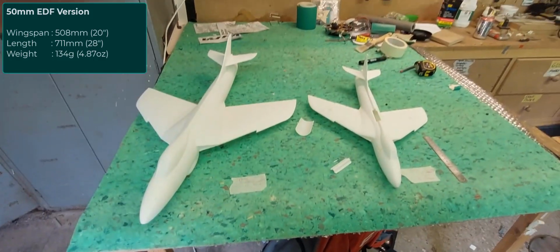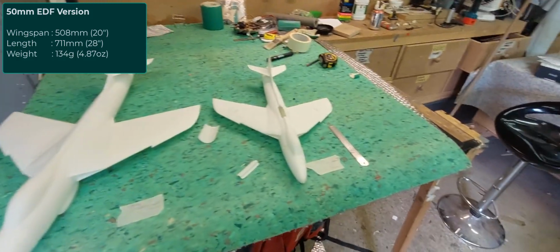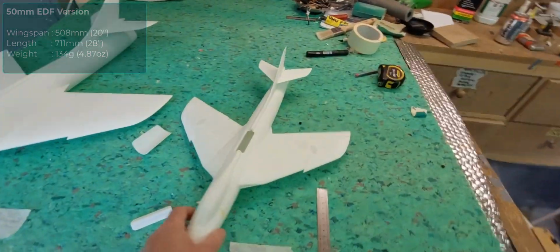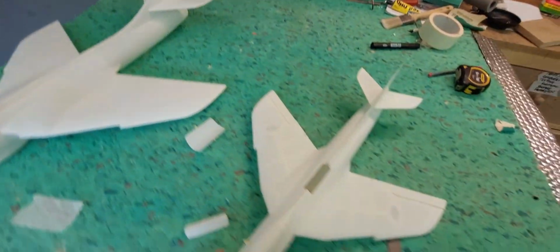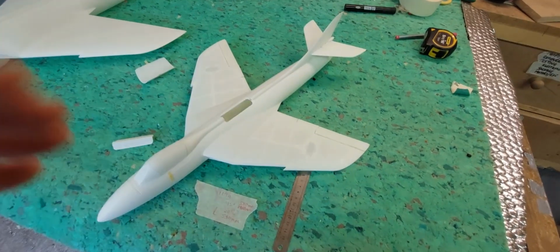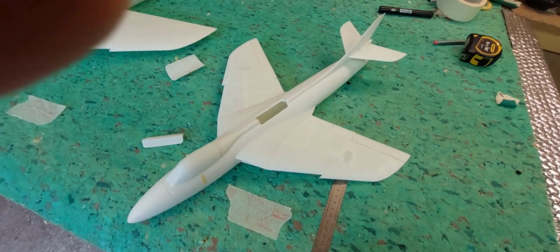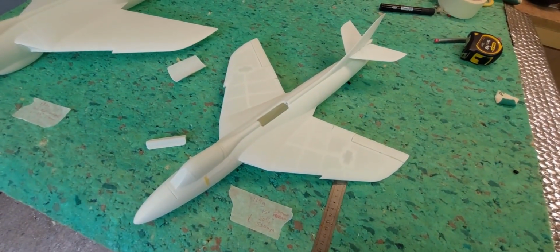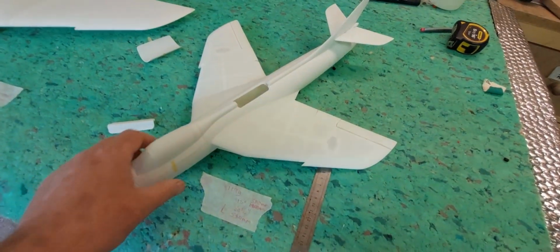Okay, so that's pretty much me up to date. I've got another version of the 30mm on the printer now. I'm just going to do the same as what I did with the 50mm and print the whole model in one skin and just feel where it needs support rather than guessing where it needs support. Once I've printed the skin, I can have a pull and a tug and bang it around and decide exactly where I need to put some support and strength.